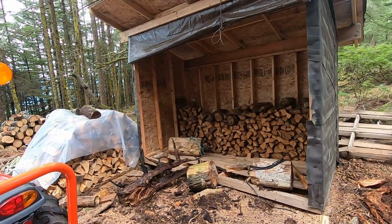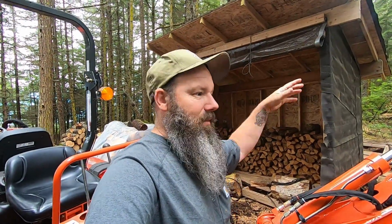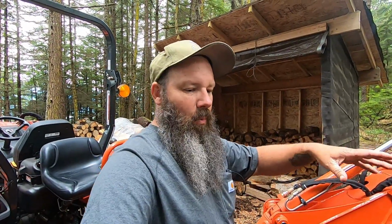We're gonna have to move the woodshed and get it into its new home. Oh, I know that's just extra work that nobody wants to see me do, but that's what we're gonna have to do, because the woodshed's gonna go back like 30 foot, and this is gonna come out 12 feet and gonna be our kitchen, I think. We've had some change of plans, but I think that's the route we're gonna go. And where the tanks are, we're gonna have this 3-inch pipe that is our waste. It's gonna come down, but we're also gonna have a water catchment, like a safety net. So if anything ruptures in the tank area, there'll be a little tube that comes up, and any water that starts to go out can go down that and go out to the leach field. That's our game plan, at least.